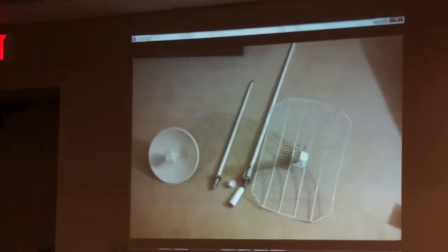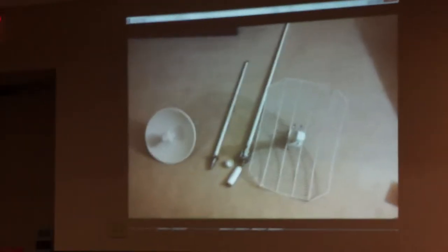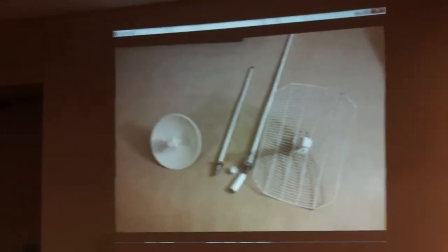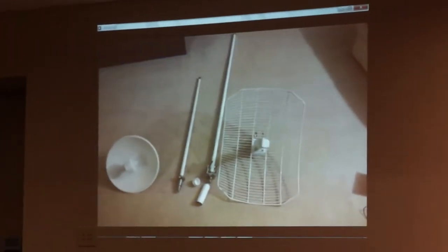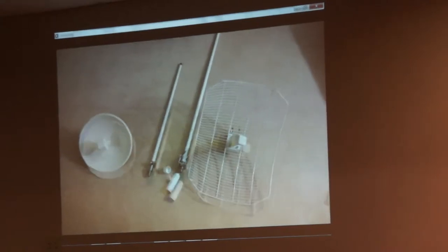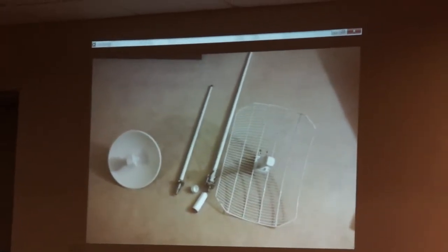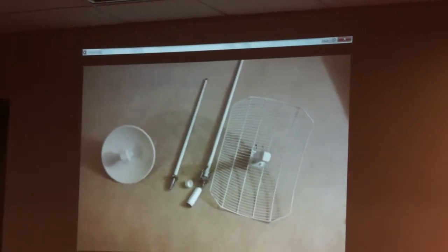Compared to standard mesh setups people are deploying now, you don't have to worry about messing with firmware, changing crystals, or dealing with frequencies. You don't need an outdoor box or hunting for power — these have Power over Ethernet which sends 24 volts up to the unit using the spare pairs inside the Cat5 cable. Power over Ethernet is very simple, no extra cables.